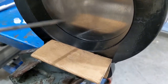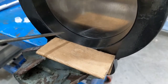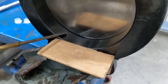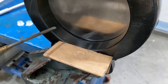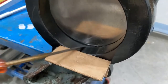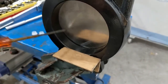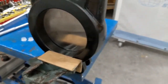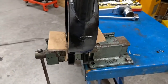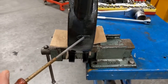As it goes down over that final last couple of millimeters, you can take it back and see how it relieves itself away from the o-ring seal face. Then as it retracts, it relieves the face — this is to stop wear and reduces wear as much as possible on that face.